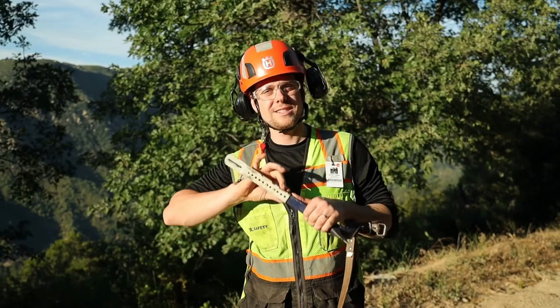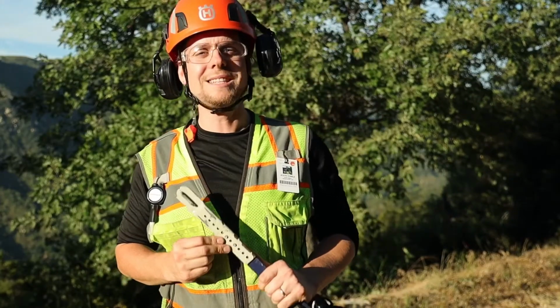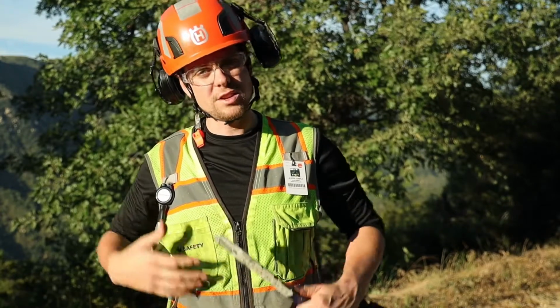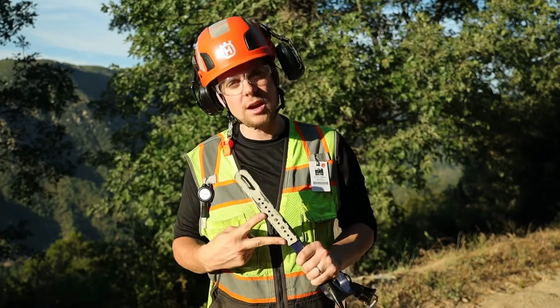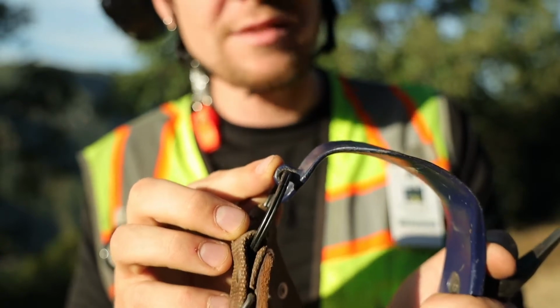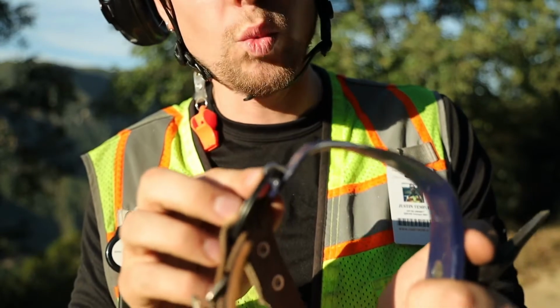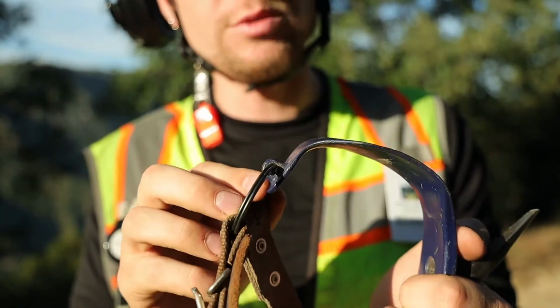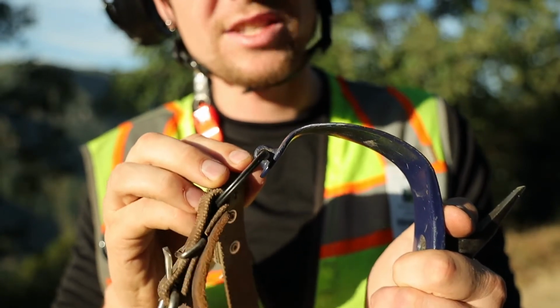The next point of interest is the sleeve and the sleeve fasteners. Sleeve fasteners need to be tightened periodically to ensure the sleeve does not move while in use. Two fasteners per shank are required at all times for safe use. Check daily as a part of your inspection and tighten if required. Next, we want to inspect the strap attachment ring for excessive wear. A quick visual inspection to ensure that the material has not been bent, warped, or worn shall be done daily to ensure the safe and secure attachment of the split ring and strap.